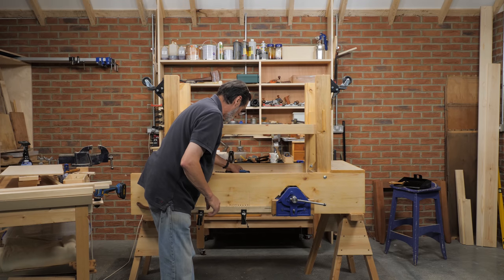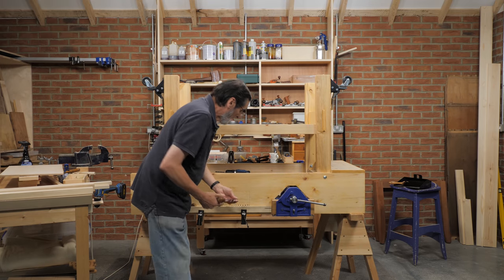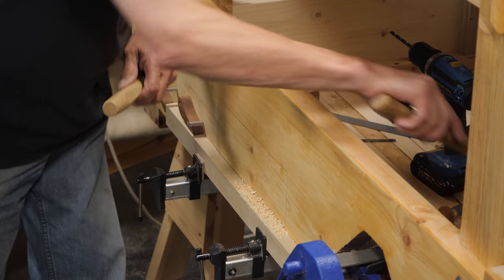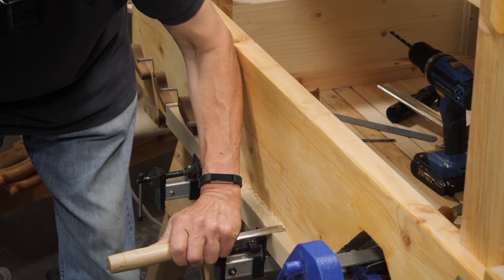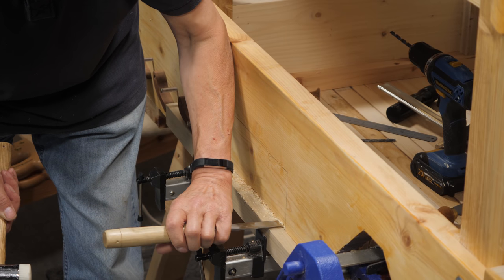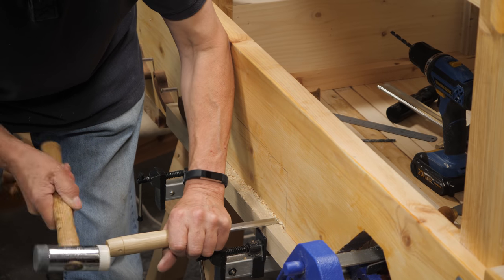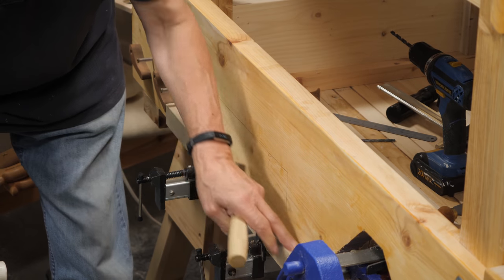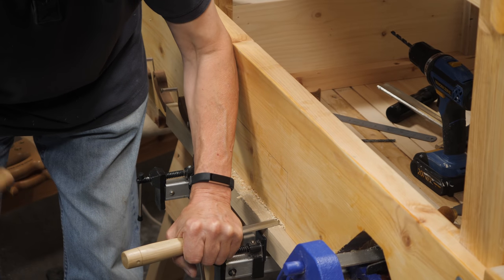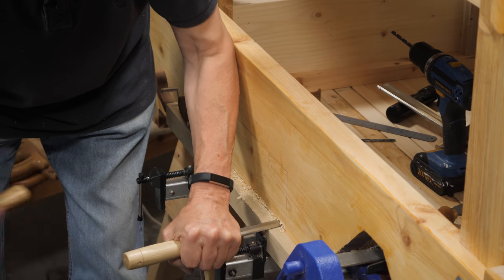What I'm going to do is stop there, because I'm going to go in now with a stab saw, or a saw like this, the one with the point on, but you can't always get straight in there. So you may have to chisel out the first bit. So just lie this along that piece of wood and chisel out some of that waste, and use the rim of this piece of wood as your guide, until you can get the compass saw in there, if you've got a compass saw.